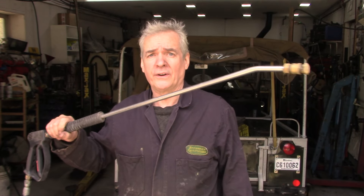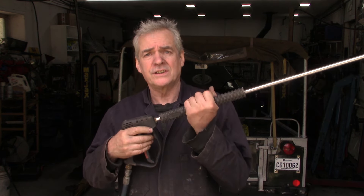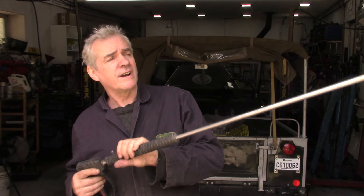So I changed the lance to this big one — the one we're all familiar with. The handles come separate which is great for doing sides of buildings and things. I had an old nozzle on the end, and it wasn't until I discovered you could buy interchangeable nozzles that it changed the machine completely. I put a restrictive nozzle in that meant water was backing up down the line and going slowly through the heating coil, but at the same time getting higher pressure because of the restriction.